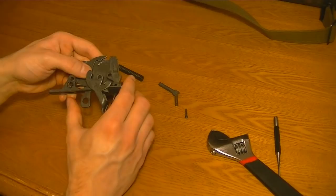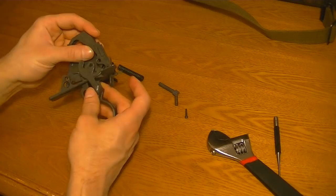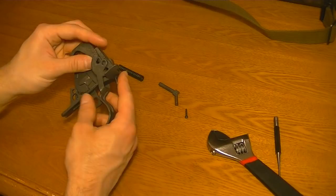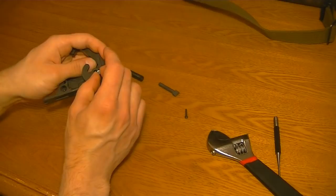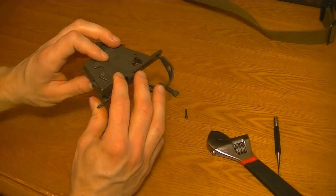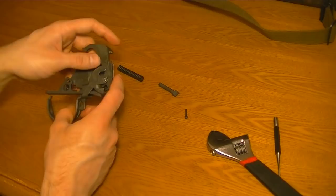Make sure you leave the safety off. And then the hammer's next — goes in there like so. Make sure this little bar is behind that part on the hammer. Otherwise, I've gotten it together before and it's like this — you think you're done, you pull the hammer down, and nothing. So make sure that's back there like that. Line up those three holes. You can see the taper on the pin and it'll only go in one way. Press that through, and when you get them in it'll be flush — nice and even.